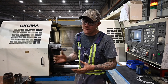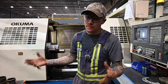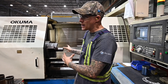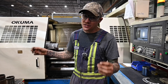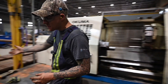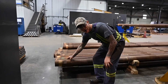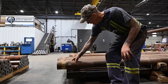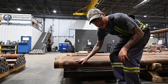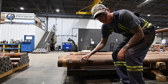We do this a lot for our core barrel type pipe. It has a 4 and 5/8 CP pin by 4 and 5/8 CP box. This stub Acme connects the tool joints together on either end. When you look at the pipe over here, the tool joint is much larger in diameter — about five and a half inches — and it comes down to four and a half. The thread I'm making on the machine right now lies right around here on both sides.